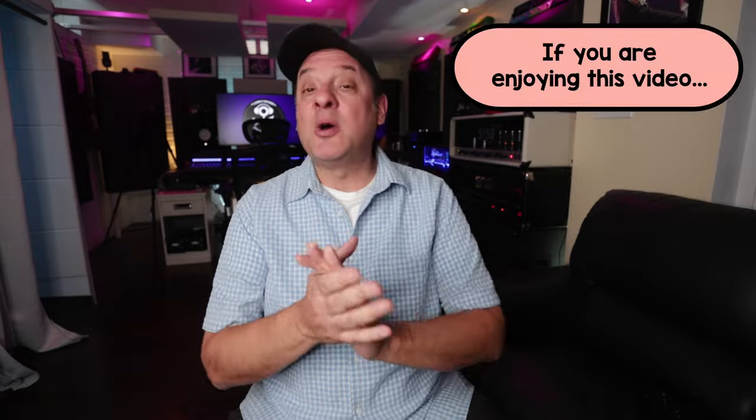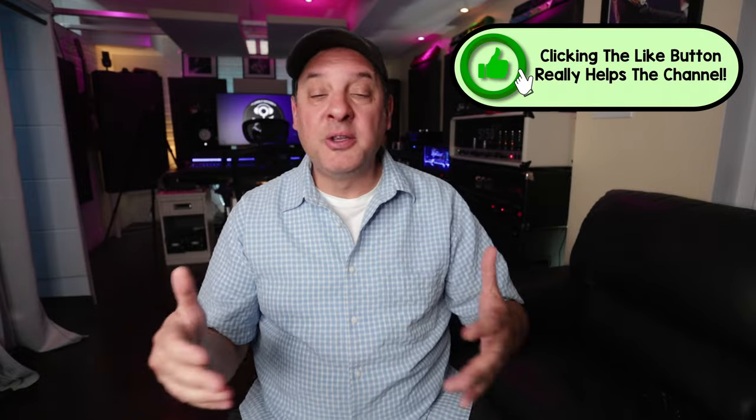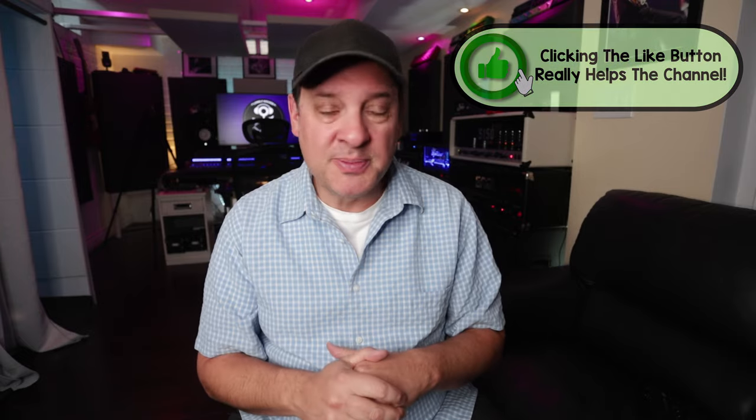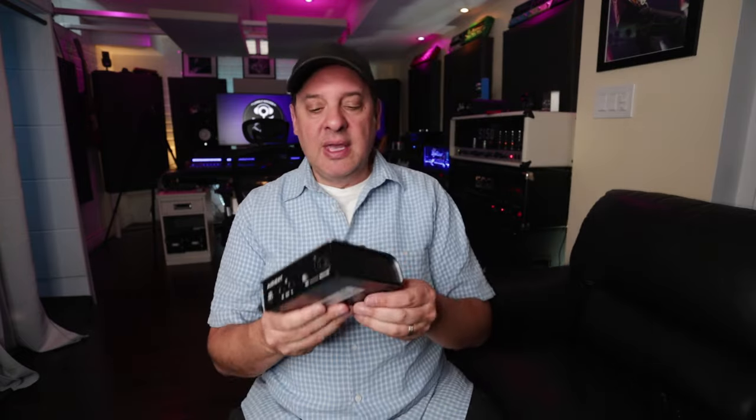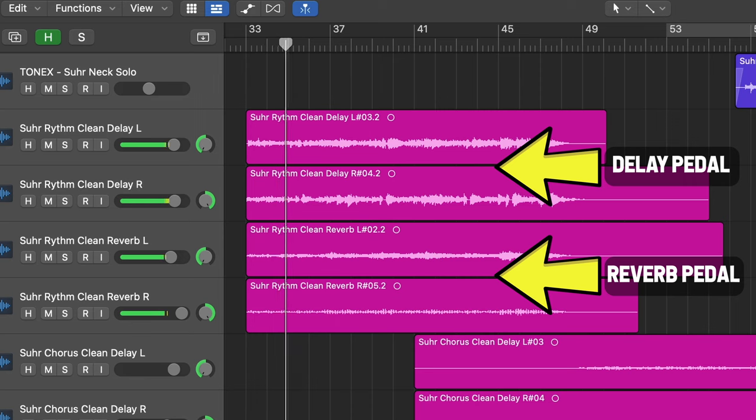I just love the tails on those effects — sounds so beautiful. Now, there's a multitude of scenarios depending on your setup and your audio interface, but regardless, you need an audio interface to do this. If you only have a simple audio interface with two outputs, those outputs are generally connected to your speaker monitors. If that's all you have, you can still do this, but you'll have to borrow one of those outputs, which means disconnecting your speaker. I'd recommend working on headphones while you record the different effects.